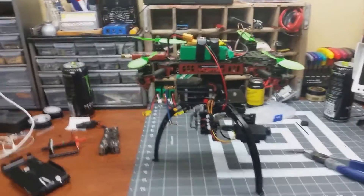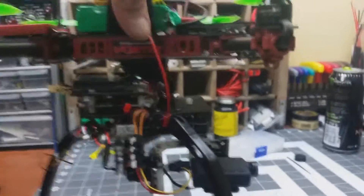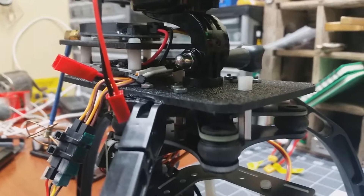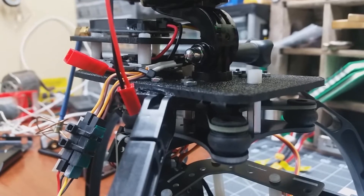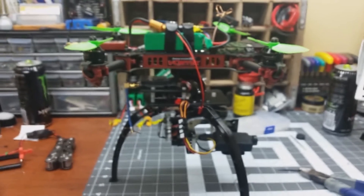She survived with no major injury — you can still see some grass jammed up in the front from a nose dive, by no means the first nose dive this vortex has ever seen. One of the benefits of this style of build is: if it takes an impact, the GoPro mount gives. Also, I've got a nylon nut on a steel standoff — that was a designed failure point. If the gimbal takes a good shock from any angle, there are only two of those nylon nuts holding the gimbal on. I did pop one of those nuts off in the crash, and that was it. I actually crashed it twice while shooting that backyard video.